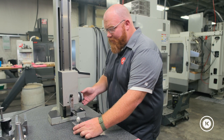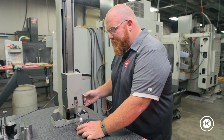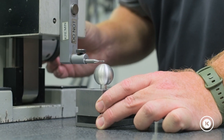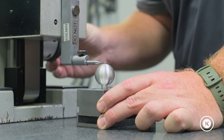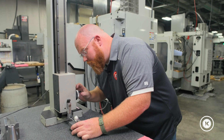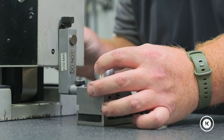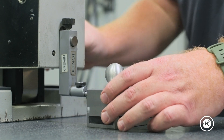And finally, we have our on center probe. These are very versatile probes, and while they can't be zeroed out on the table, there's many, many uses for them. Here I'll demonstrate finding the high spot of a sphere to check it against the overall length of the part. The narrow tip of the probe is able to get into many spots that other probes simply can't.